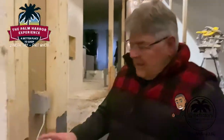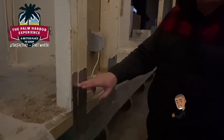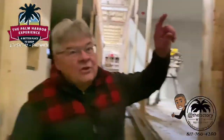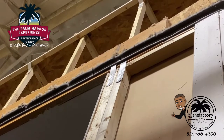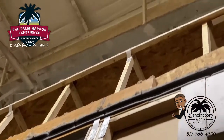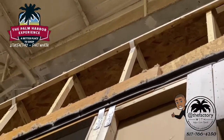One of the questions sent in was about our strapping. We strap the floor and walls together with those steel strappings — one and a half inches wide. The question was: do we strap the roof to the same wall? If you turn the camera, you can see the straps come down the wall, bridge the gap line, and go across to the roof section. Yes, it is strapped from the roof down to the walls, as well as the walls down to the floor.